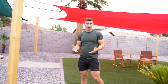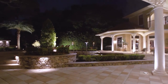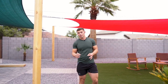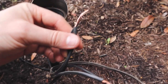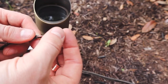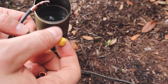Lighting is key. A tip here from my buddy who used to own a landscaping business in Arizona: solar lights kind of suck. Unless you go super high-end, hundreds-of-dollars solar, it's just not as bright. So you're going to want to run electricity — they have low voltage electricity you guys can run under your gravel, your grass, or under pavers. They have low voltage lighting where you can set up a whole bunch of outdoor lighting and it literally doesn't take that much electricity at all. Definitely look into that.